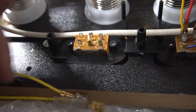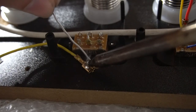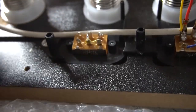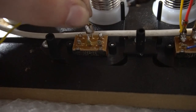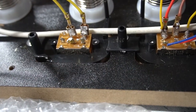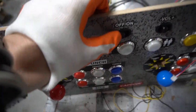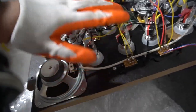Let's not make that touch yet. I'm going to bring up the second one - take this solder and fill in this here. Filling it all in. I'm going to reheat this and now that's hot. I got one in. We're in - look at this, I'm pulling it up, we're in! That is a little bit of a challenge - those wires on the power switch are very short. Now we connected it here, and now switch is off, and now we are on. On and off switch hardwired and soldered. Look at that - literally tight, doesn't come out. We are going to hot glue this.